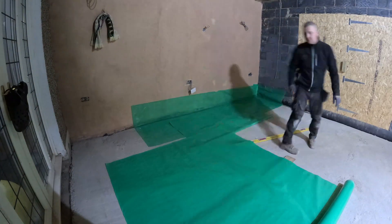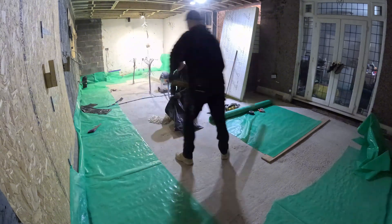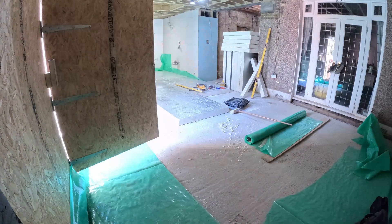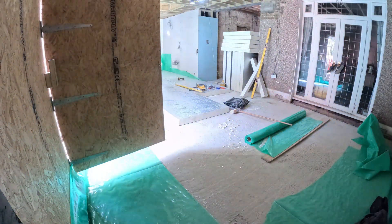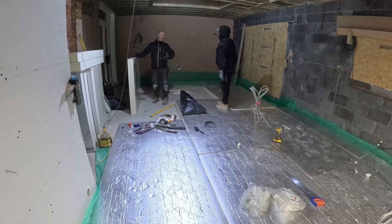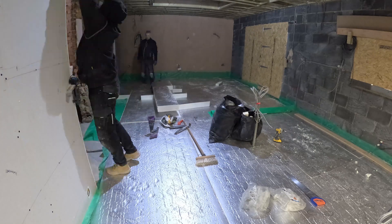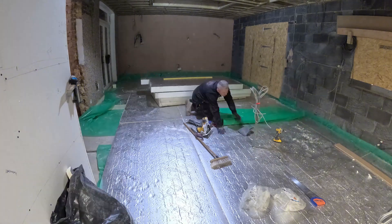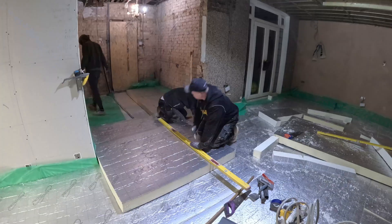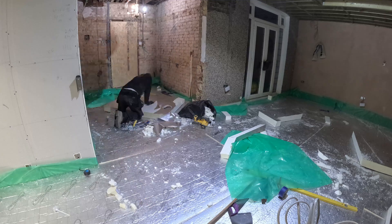The concrete has dried nicely and it's time to lay down the 120mm Cellotex insulation. We are adding extra pieces of VCL protection around the perimeter — VCL is like the DPM but for flat roofs, slightly thinner. This step is completely unnecessary, but both sides of our extension have a party wall and I'm not sure how well it was built, so it's a little precaution for peace of mind. The insulation needs to be staggered and taped with aluminium tape, then we can lay down the underfloor heating pipes.